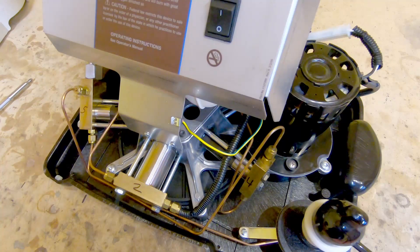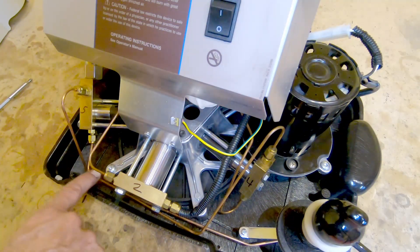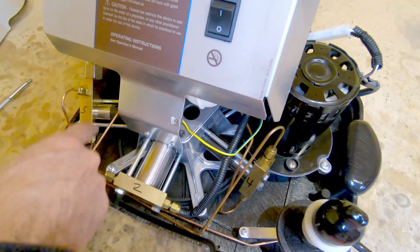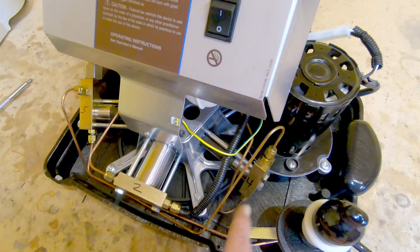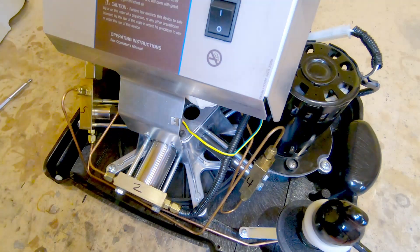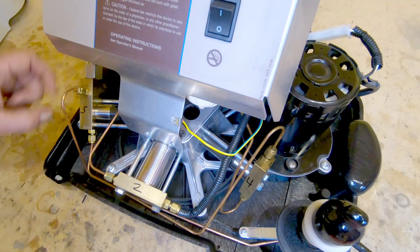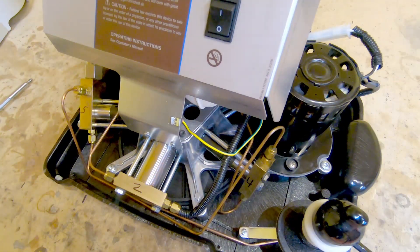It's important to look at the plumbing — you've got these very small little tubes here with hexagonal fittings, and these tubes and fittings all have to be removed. In particular, the fourth stage can be tricky because it's possible when you disassemble it to put the cylinder head on in the backward direction, and this will not work. The fifth stage is a little bit easier to identify because it has a pressure sensor coming out of the far end, and if you put it on in the wrong direction the hoses don't line up. But the fourth stage is very easy to get wrong.